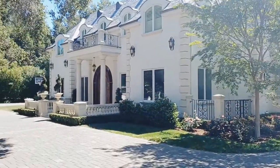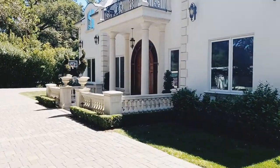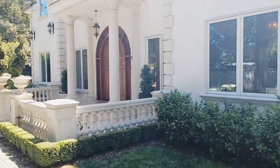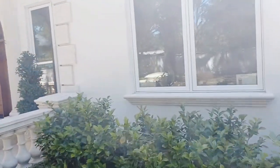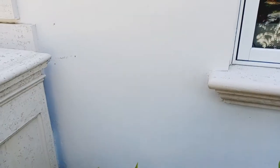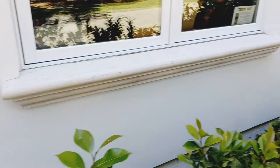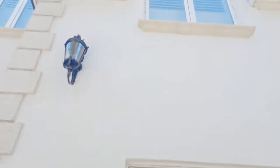Over here was another add-on. I noticed all the stucco below this window was peeling off and crumbling. I ended up taking all that off — it took about four patches. I used the marble finish stucco, then put some primer patch over that, primed it, and painted it. They were happy with this. Then I just painted this whole side right up to the peak.